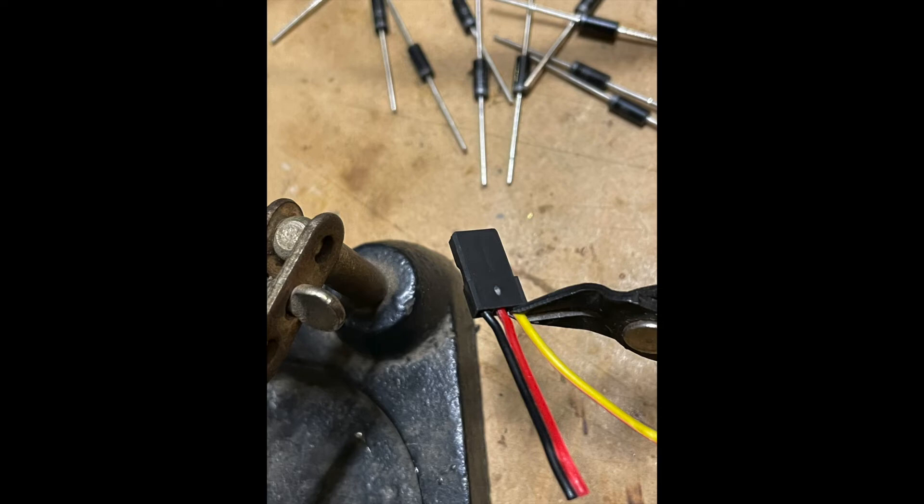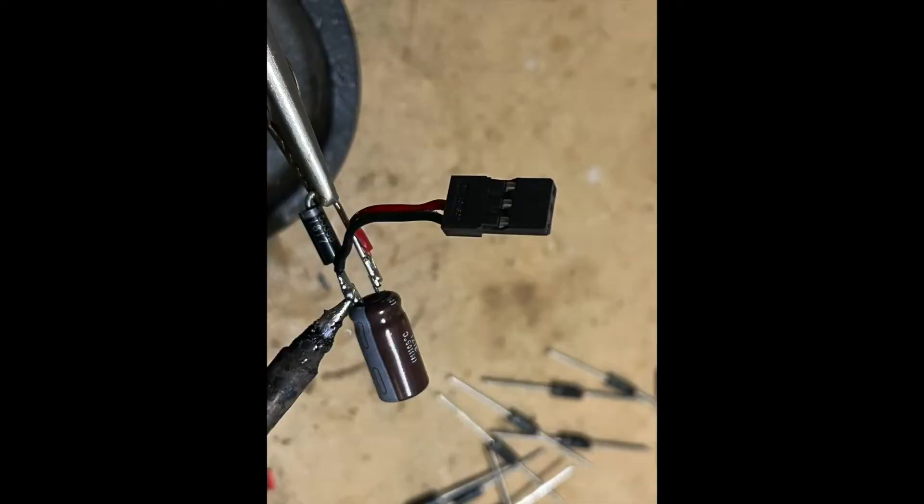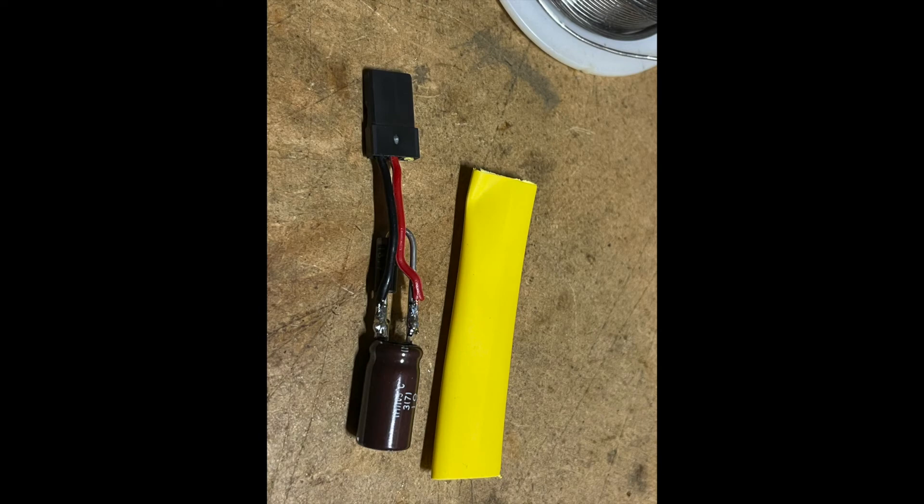Trim the signal wire flush for the servo connector. Leaving its pin in will help it stay on the servo rail, plugged in tightly. Strip and tin the wires for the servo plug, and solder them to the zener diode and capacitor. Make sure there are no sharp tails from the solder, and double-check the normal, correct polarity of the capacitor, and that the zener diode is placed in the opposite direction.